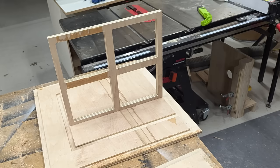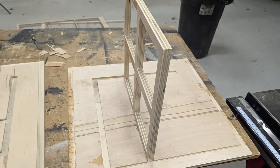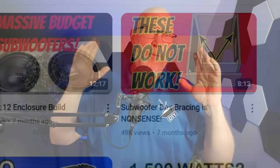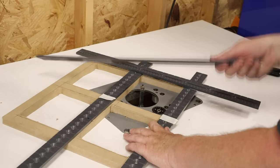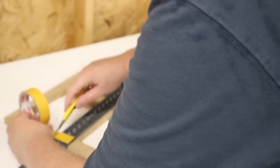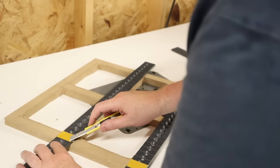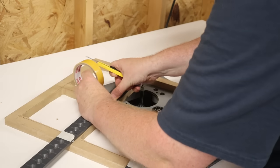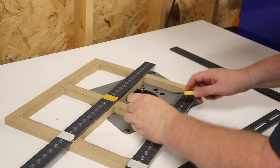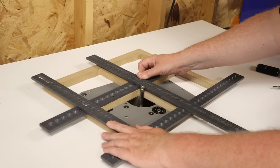You can see here that I'm using a window brace for this build. In a previous video, I commented about the downsides of this style of brace, and a lot of people walked away with the impression that you should not use internal bracing. That's not what I said. What I said was this brace took a lot of work, and there are faster, easier ways to brace your enclosure. To do this, you've got to mark out four holes, rough cut all the pieces, and then flush trim them with the router — involving a lot of time at the router table cutting template tape and sticking templates to the workpiece. If you like spending your entire day making square-shaped holes at the router table, knock yourself out.